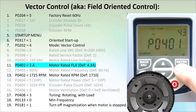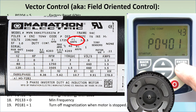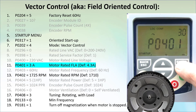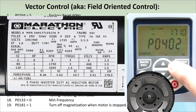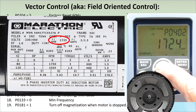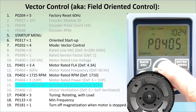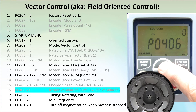Parameter 400 is where we enter the exact line voltage we are using, and the 220 default is what we are using. Parameter 401 is the rated full load amps – the motor's faceplate shows 3 amps, so we enter that here. The frequency is 60 Hz – that's fine. The rated speed from the motor's faceplate is 1725, so I will enter that. A value of 5 for this drive corresponds to 1 horsepower. We do have a 1024 PPR encoder, and this is a self-ventilated motor. And we are done.